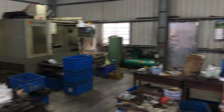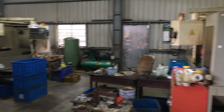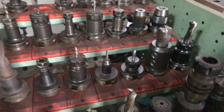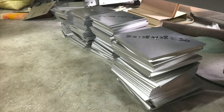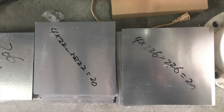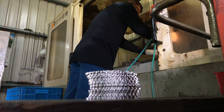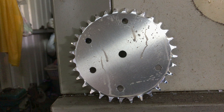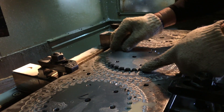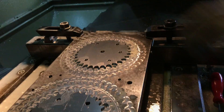First Components chainring CNC processing workshop has three CNC machines and many more cutters. Every chainring is initially cut from an aluminum blank a bit bigger than the circumference of the finished chainring. The teeth have already been cut in this batch of narrow-wide chainrings, and this CNC session will cut the narrow-wide profile into each tooth, doing one side at a time.